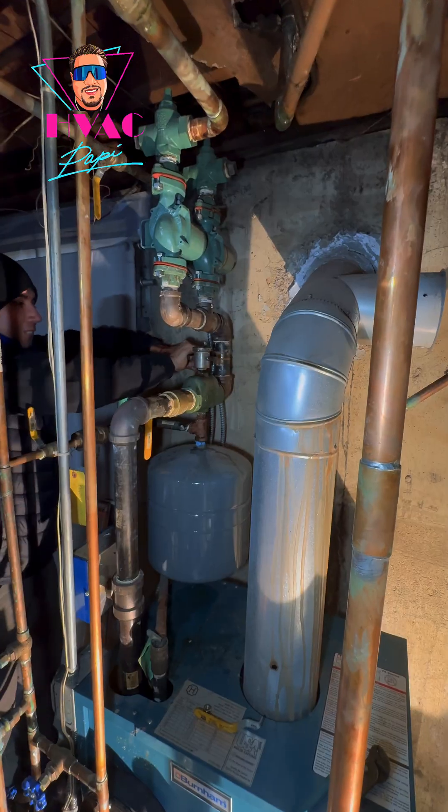But we have another issue that we didn't know before. The boiler was cold. If you know anything about boilers — it's a hot water system, it expands. You heat water in a sealed pipe system, it expands. So in this case, it started leaking from the relief valve. Makes sense because it was cold, it wasn't leaking before. But now that you heat up the boiler, you've started to make heat, it started to expand, temperature started to go up, it's building pressure, and it's leaking from the relief valve.